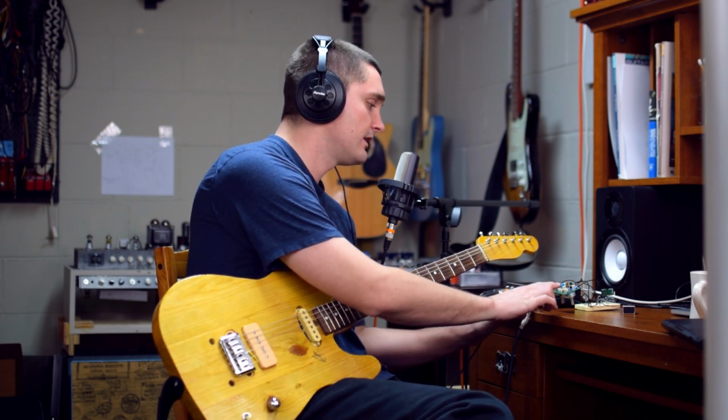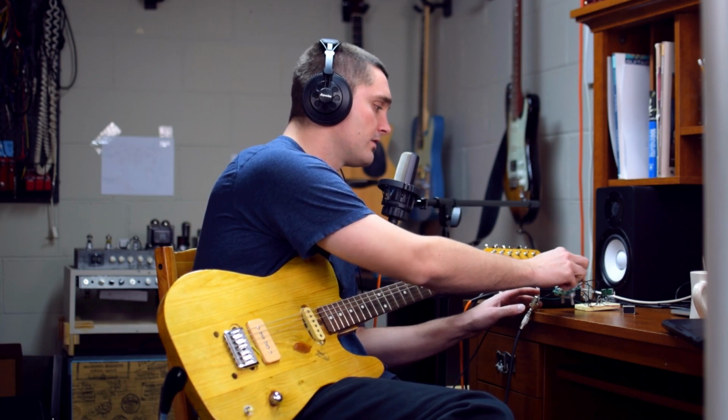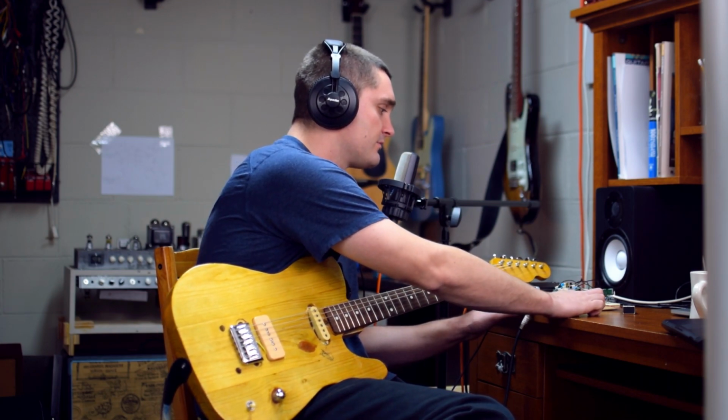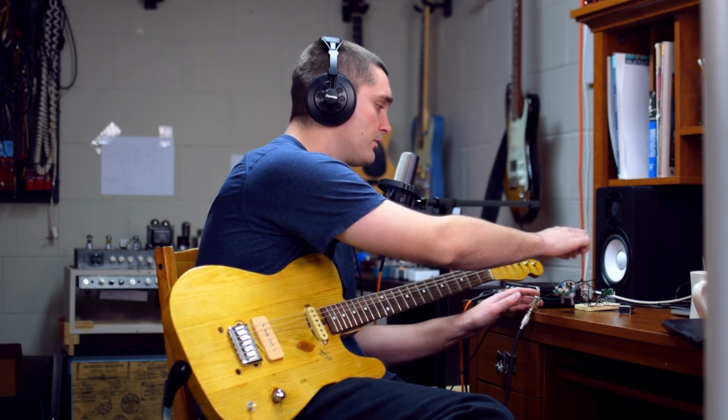show this off. So I've got my board completed, populated. I've got my 4 outboarding wires. That's the input, output, 9-volt in, and ground. And I'm just running those into my breadboard. And then the breadboard has got the battery and the input and output jacks.